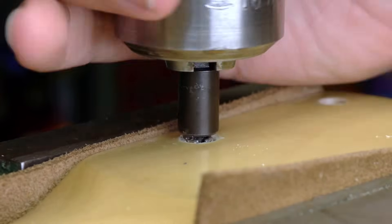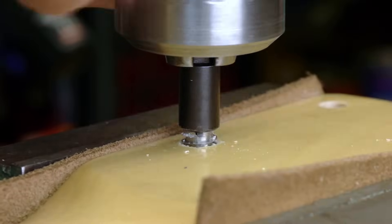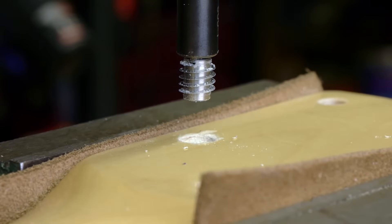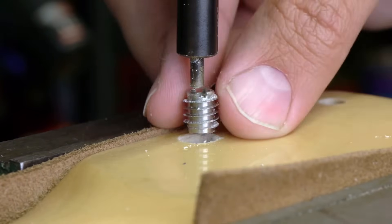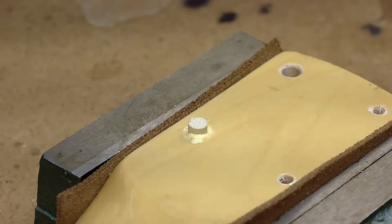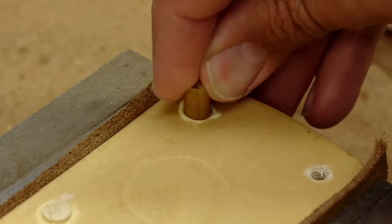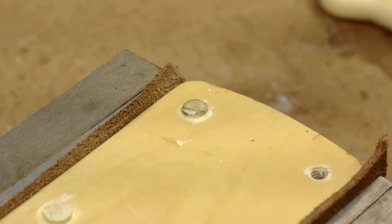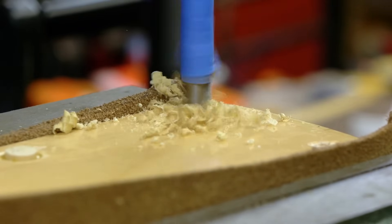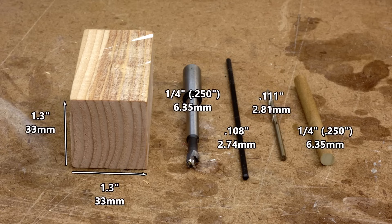If you screw up the installation on any of the inserts, they're very easy to remove with the drive tool the same way you installed them. Simply press the drive tool into the insert and rotate it counterclockwise until it catches, then continue rotating counterclockwise while slowly easing up on the drill press lever to let it rise. You'll have the insert out in no time, with no tear-out. Fill the hole with glue and a hardwood dowel for a second chance. You can also use my DIY dowel center marking jig to mark the center on the dowel, then precut it flush with or slightly above the surface of the neck before driving it in. Use a brad point bit to re-drill using the set mark as a guide. Check the description box or click the card at the top for a link to my video on the jig.